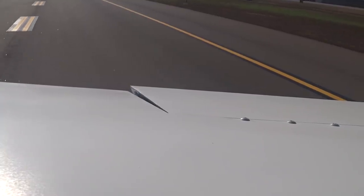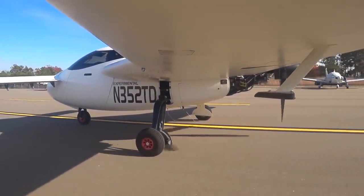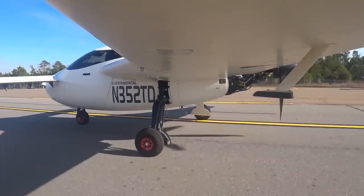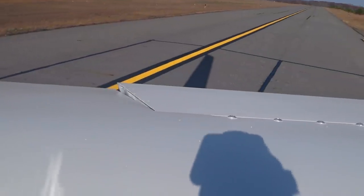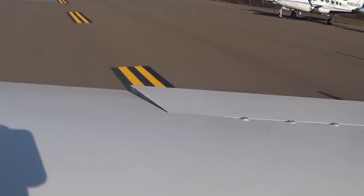So far I haven't felt even the slightest bit of side movement on the stick while taxiing — very little play at all. I may need to take a little weight out of the right-hand aileron to perfectly balance it. But it's so much better than before when I just had the spades on. I'm going to go down to runway 5 and do a short 40-knot run to see how it feels.